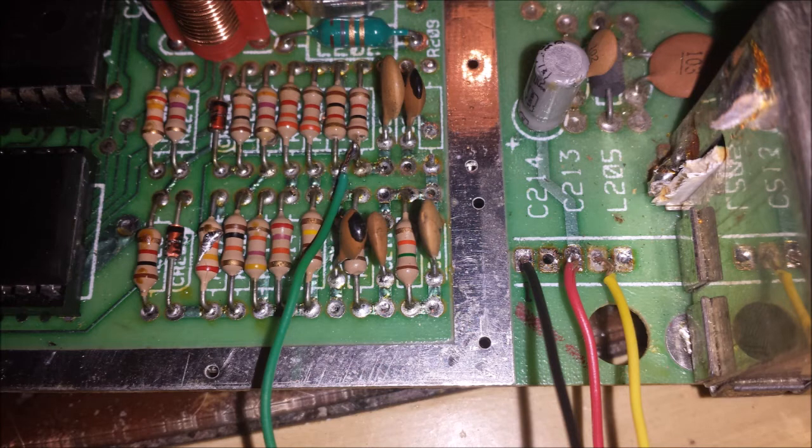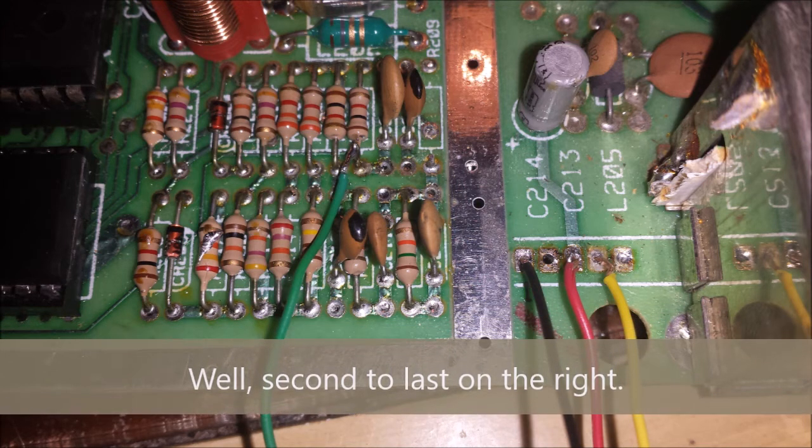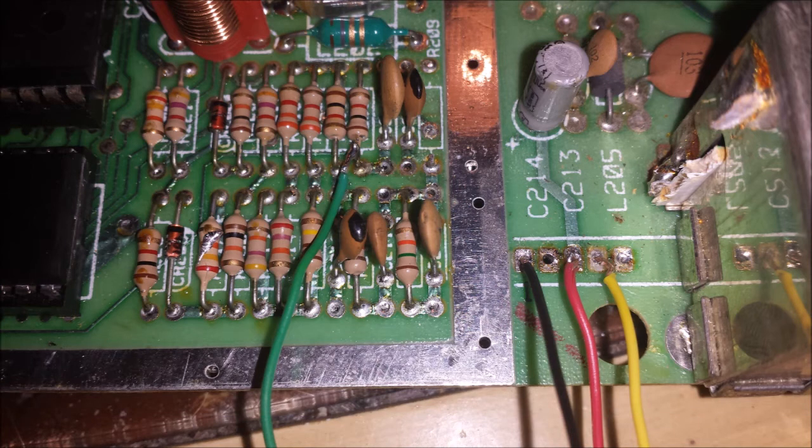The instructions tell you which wires on your little circuit board to solder to which points. The green wire goes to audio, the black goes into that hole for ground, the red is VCC, and the yellow wire that goes into the last hole on the right is composite. You do want to put them into the holes and then solder them. The green wire solders directly onto the leg of what I think is a resistor, and the other wires go into the holes where the RF board was previously soldered.